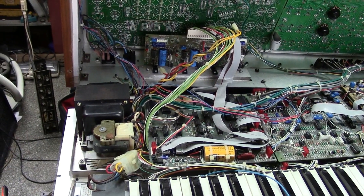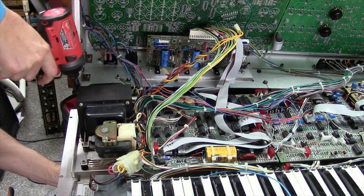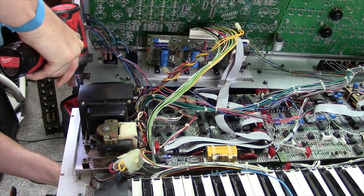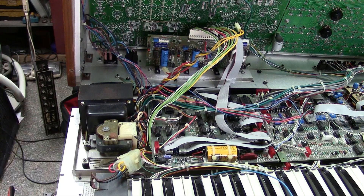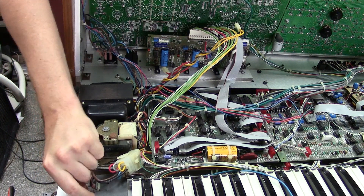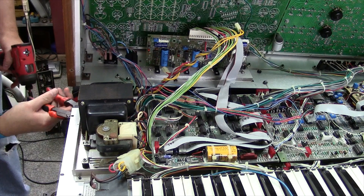It takes some work to get it like you want it, but you can do this. I recommend removing everything out of the chassis because it vibrates hard and you'll be dropping stuff off of it. It takes impact to get these things off the red Loctite — you can't just use a basic approach. Once you get it loose enough, grab around the screw on the bottom and run it out with the impact.